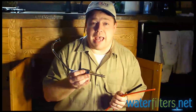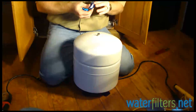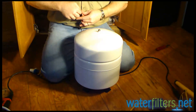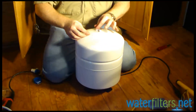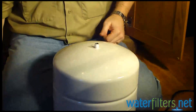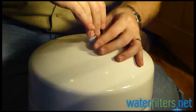You don't always have to use the air gap in every situation, and we're not. So now I want to attach the ball valve to the top of the tank. I'm going to put a little piece of Teflon tape on these threads — just a tiny piece — and wrap these threads. Teflon tape is important; it's going to ensure that we don't have any leaks.